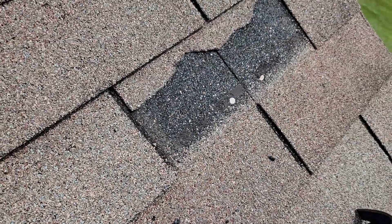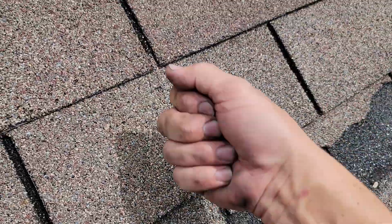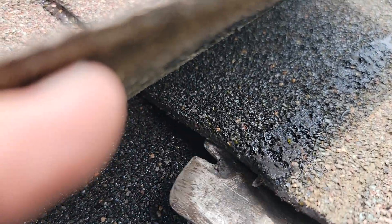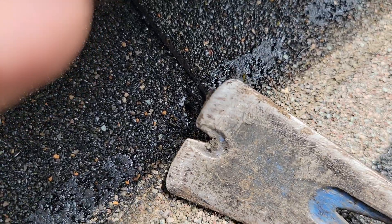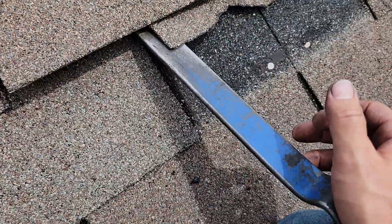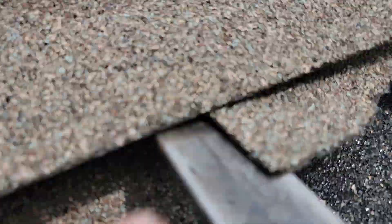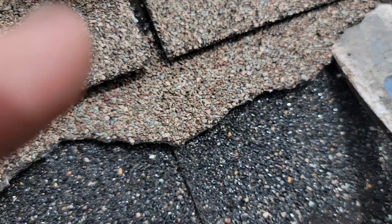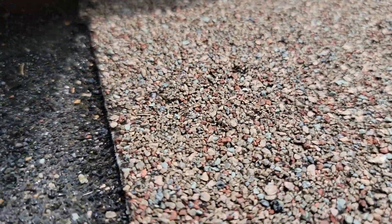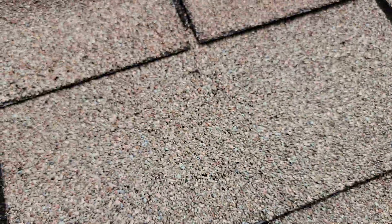The second tip with the flat bar: instead of trying to tear all this loose to get your knife up under there, you've already got it cut as far as you can. Take your flat bar — this little center point right here — and get that in between there and shove it up until it hits and won't go any farther. Then you just give this side a nice little tap like that. Same on this side — get it up under here, and essentially that is going to act like a knife. And you cut your piece out.